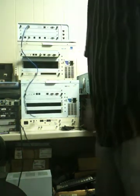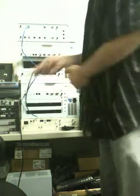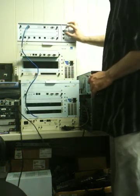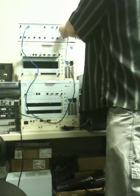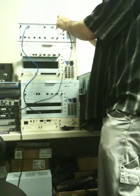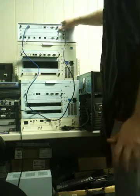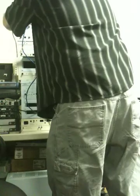Now, the data cable that was plugged into the uplink card goes into a different spot on the V5000 chassis. You'll have two ports — you'll want to go to either one of those ports. It'll say '10/100M port.' Just plug it in there. After everything's hooked back up, go ahead and hook up the power to the V5000 chassis.